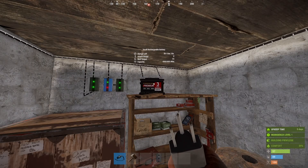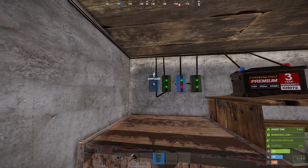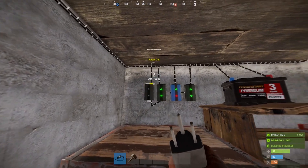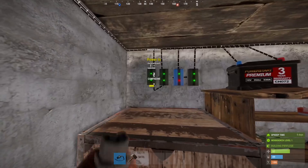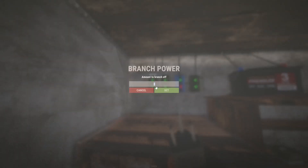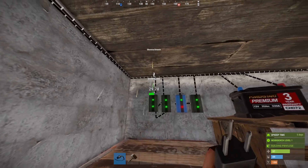The max output on this battery is 15. I have allocated five of that 15 to the branch. So even though only three is being used, five of that power is no longer available to allocate to any other circuit. That's key when deciding whether you need a small or large battery — it's mostly about output. If I try and plug in more circuits and allocate power to them, I might not have power to those circuits because the max output has already been allocated. So I'm putting another branch here so I've got somewhere to branch off in the future without rewiring. I'll take the power out from this branch into the next branch, and set it to one — all the power I need for my door closer.